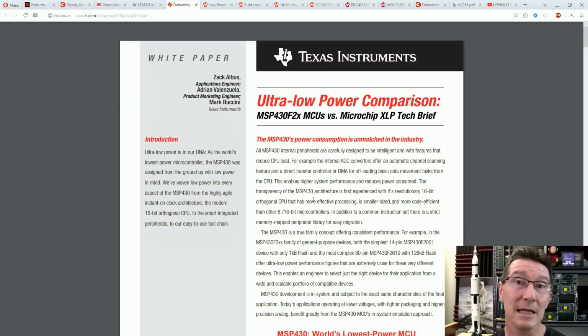So what do you need for a microcontroller plus LCD solution? Well, first of all, you need an ultra low power microcontroller. There are quite a few of those on the market from many manufacturers, no worries. But you also need one that's got the LCD driver built in. In particular, a 6-digit display is quite a large requirement in terms of the number of segments to drive, so you're looking at a bigger chip.